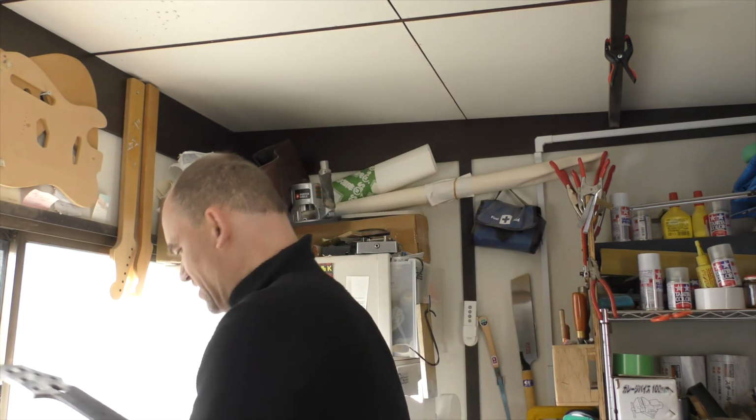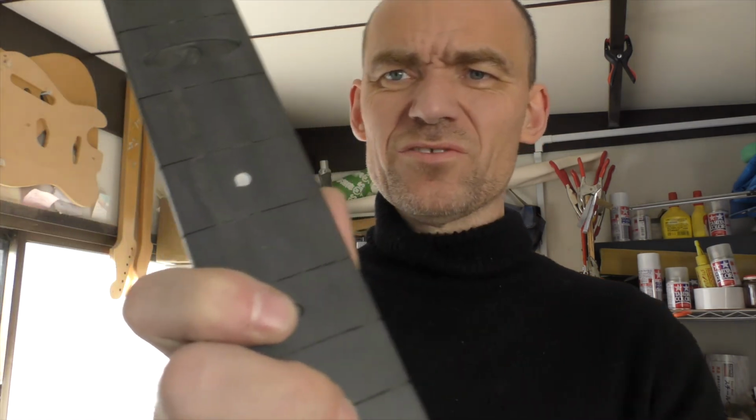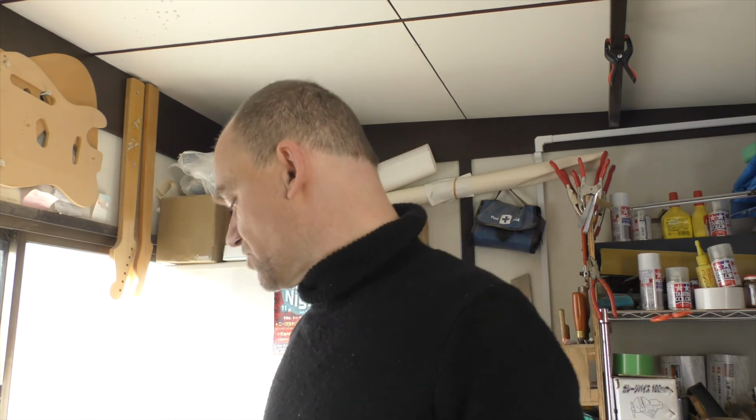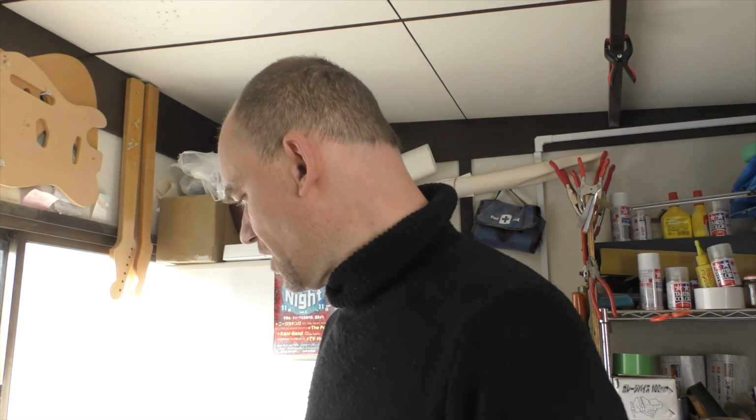And then the round inlays, well, they're not round at all. And it's not just a case of the top of them being misshapen and you sanding down. There's a circle underneath and it's just not round. And that's not acceptable for me. And they're also very loose. So I decided, well, I have to do something about this. And so I sent off and I've gotten some pieces of mother of pearl, and I've gotten some dots, which are slightly too large, but I will make them the correct size. And once I've got the inlays done, I will be able to move on with this build.